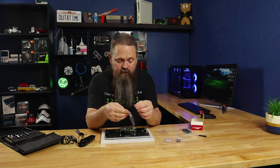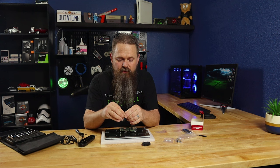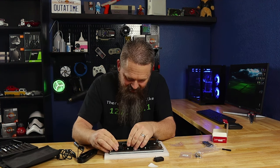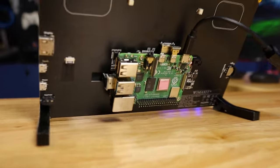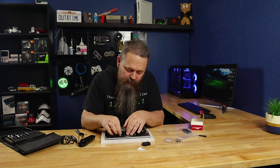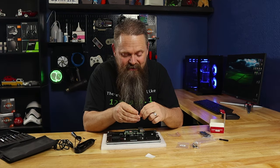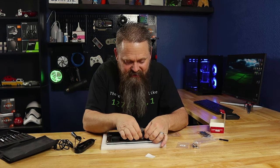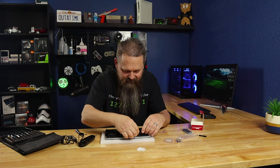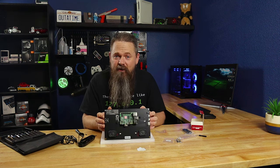Next, hook up the little speakers that come with it. These speakers have double-sided sticky on the back, so you pull the little backing off and stick them to the back of the PCB. It has little lines on the PCB to help you line it up. It's actually easier to plug the speaker connector in before you stick the speaker down, so with the second speaker I plugged it in first. Once it's plugged in, pull the backing off and stick it down on the silk-screened area right on the PCB. Now both speakers are installed.